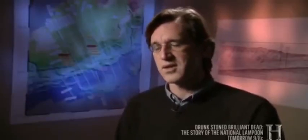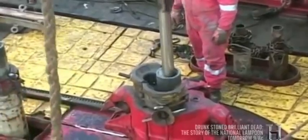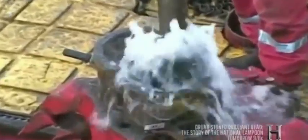Prior to this, without a riser system, scientific ocean drilling has always been done just with the drill string itself cutting the hole. Seawater is pumped down the drill string to flush the pieces of rock out of the hole, and they just pile up on the seafloor. That works fine for drilling several thousand feet, but as you get deeper and deeper, it gets harder and harder to maintain the hole that way. So to go deeper, we need this riser system. So it can drill two or three, four times deeper than we've ever been able to drill in the ocean floor before.